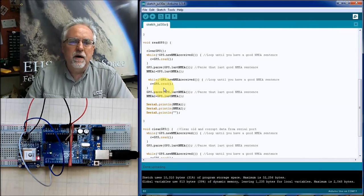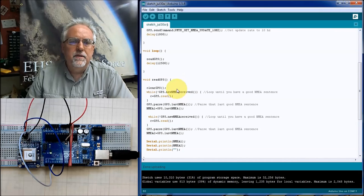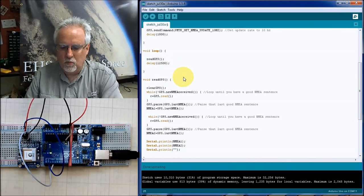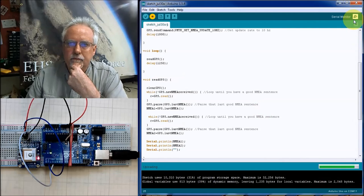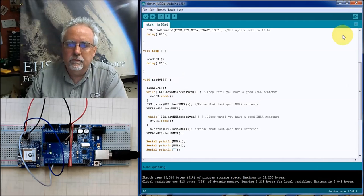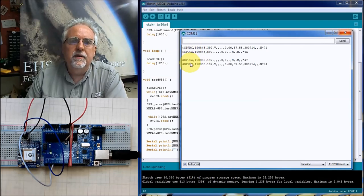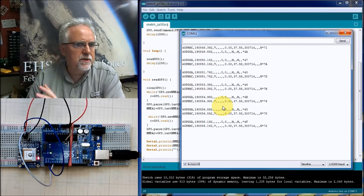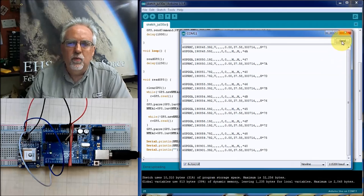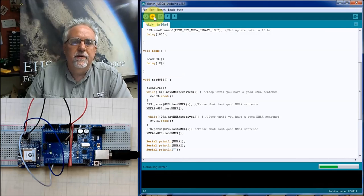Let's go to, where were we? Our delay is right here. Let's go back to 1 second, 1 1/4 second, see what happens. C and an A. AC, AC, AC, that is looking good. So I think if we do three reads, we completely flush out that serial port and we are in good shape. Okay, let's go just to try the other end, and this will be the last thing that we try.